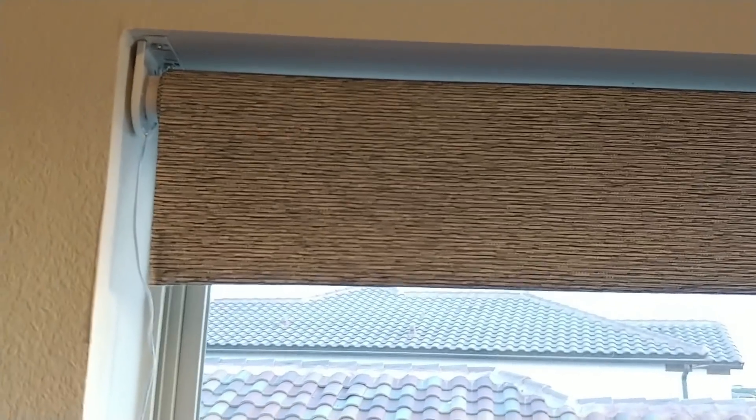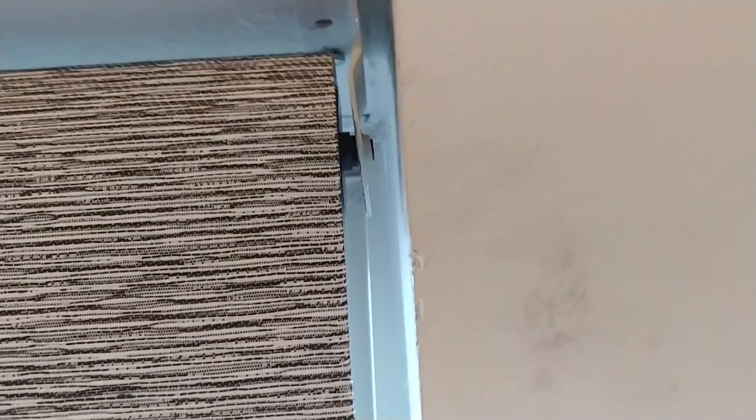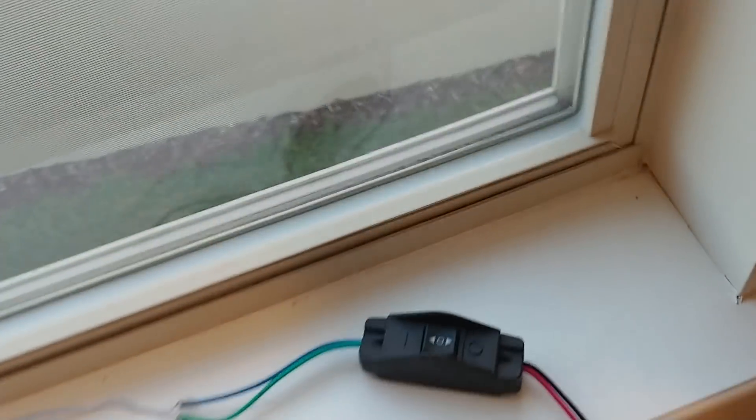Here's what I've done so far. I have that little tube inside my old roller shade. I have the old clutch popped out and sitting right there — that's the little manual drawstring sort of setup. This is the other end of it. I couldn't get it in; it was a really tight fit. That was the first major problem. It's supposed to be for a 1.5 inch tube, but I think if I do another one of these, I'm going to have to shave the edges down a little bit so it fits better — I pretty much had to get a hammer to it. I left the old end on and for now it works. This is the motor end, and without any programming, if I push the button, this is what it does.